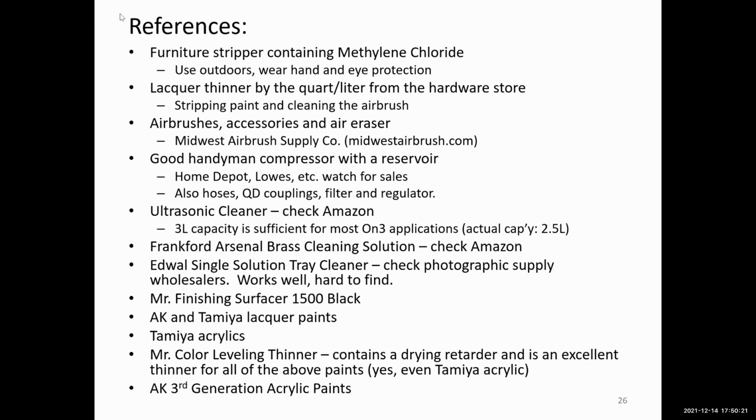And the beauty of the 400 is it is so fine that if you had a gloss paint finish that you didn't like, you can make it flat. You can actually dust that 400 over a gloss finish, and it will abrade the surface, make it a nice flat surface without removing any paint. Okay. Yeah, I must be using the 240 because it would for sure just take the paint off.